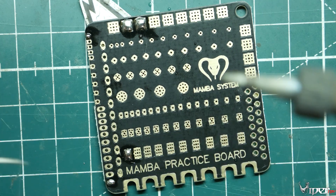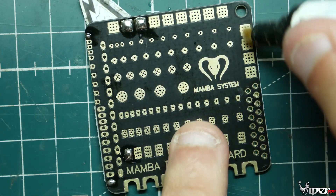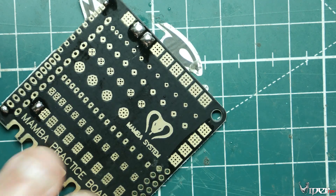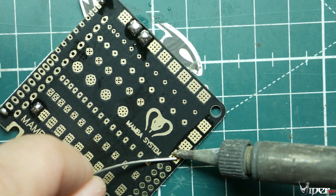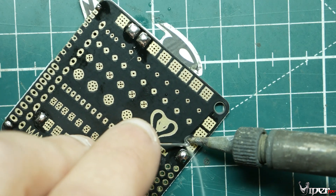I do use flux, so the proper way to do any soldering is to go ahead and get your flux. I have a flux pen here — let's go ahead and apply that right there on that side. Then we're going to go ahead and just heat it up like that. The tip is already tinned from before, and let's feed in some solder and get that nice little shiny ball there. That's how you know you did a good, nice solder joint.